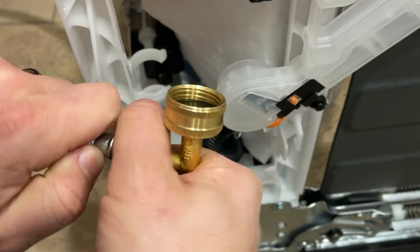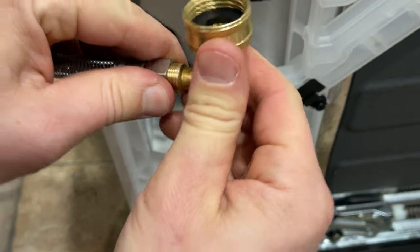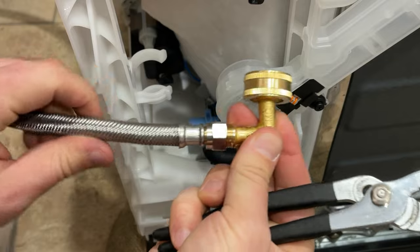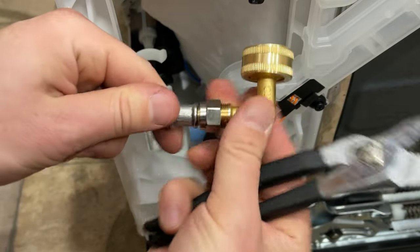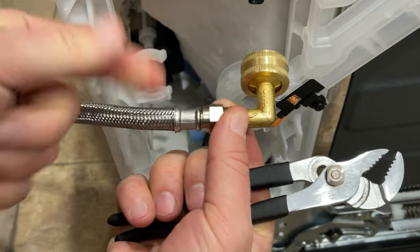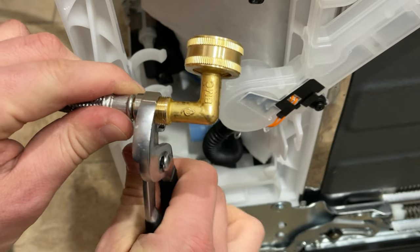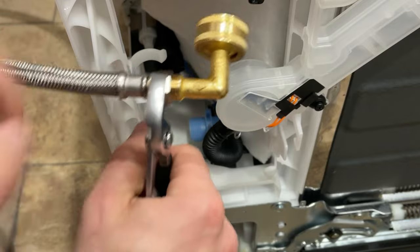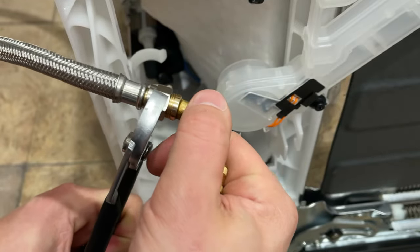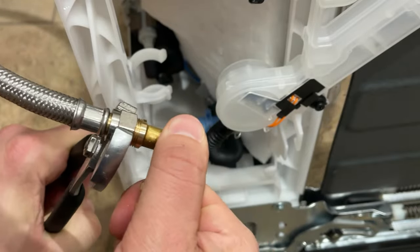You don't need any pipe tape — this is a compression fitting, so you can tighten it finger tight and then take a pliers or a wrench and give it another turn or half turn. The reason you want to do this part first is because you can turn this tube inside, so if you tighten it all the way you'll just be spinning the tube, which won't work. Hold the nut right here and then turn this side to get it all the way in. You'll feel a click when it's seated against the washer, then just turn it a little bit more and you're good.